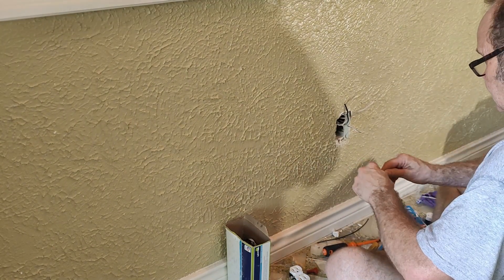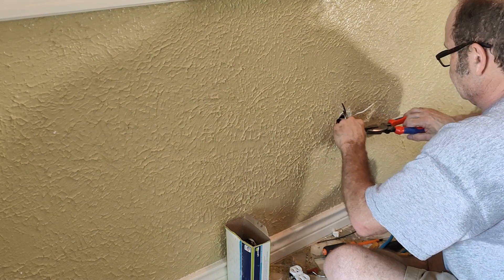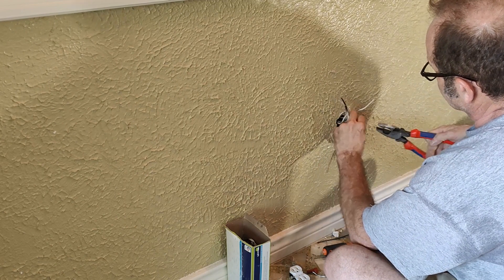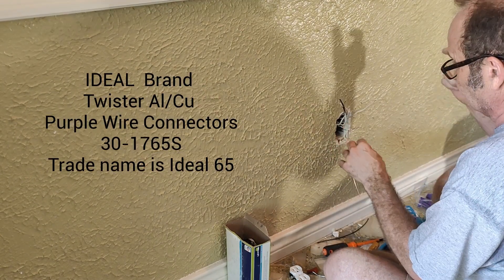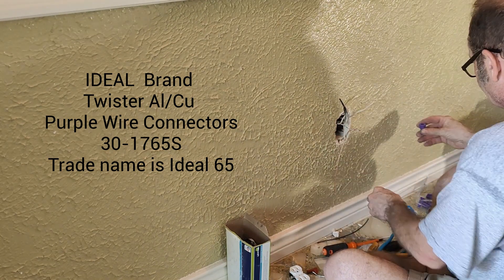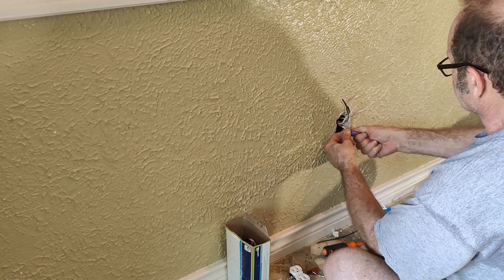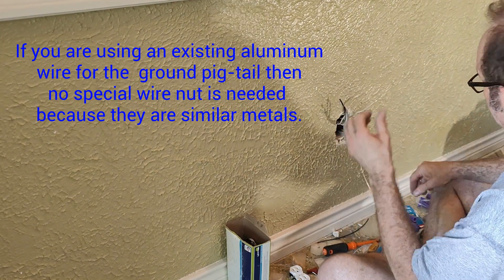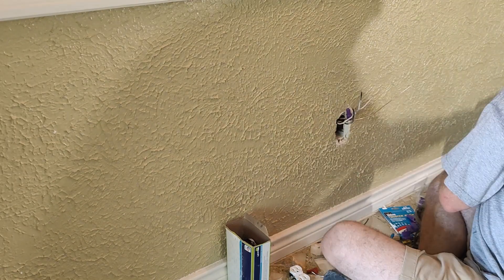You can reuse these grounds. I have a copper one here and I'm going to replace this with a pigtail to give us a little more length. Just twist it a little bit — you don't want a whole lot. Never over-twist aluminum; it's not forgiving that way. That's another problem with it — it's not as forgiving as copper when you're moving it around a lot. This is an Ideal 65 purple wire nut, all gooped up, and we're going to use that for the ground pigtail. For 14 gauge copper and 12 gauge aluminum, these are code-sized correctly as far as capacities.